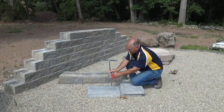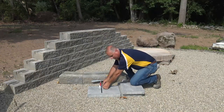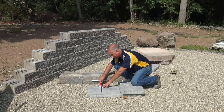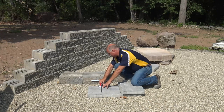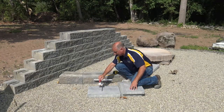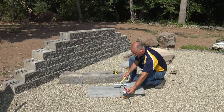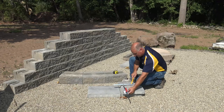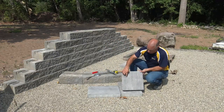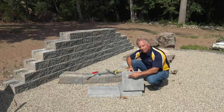Now I'm going to loosen this up for the left side. This mark simulates the corner to paver. I'm going to stretch this again — you can see it's tight right here, and it will automatically stay once I push it out. I hold it to this angle and lock it. Now I hold this to this point and, using my marker, I mark by the side. These are the two angles. So now I'll cut this paver and drop it into place.